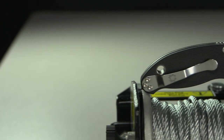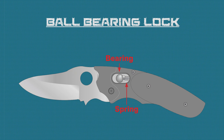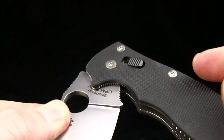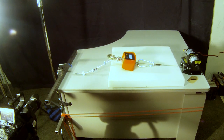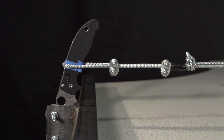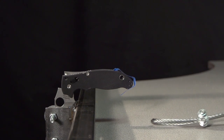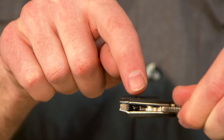Next up, the ball bearing lock. The Manix II has stainless steel liners, G10 scales, and an S30V steel blade. Ball bearing locks work exactly as named, using a small metal ball bearing — the bearing is pushed forward to a notch in the tang with constant pressure from a spring, and the liners are milled on both sides so the ball bearing can be drawn back to disengage the blade. The ball bearing lock didn't go down without a fight: the bearing pushed out of its spring, broke the screws, and is now wedged up in the liner. It took 229.3 pounds.